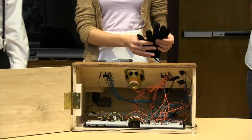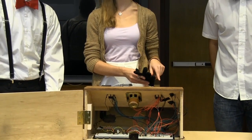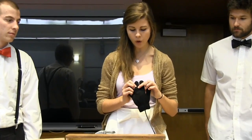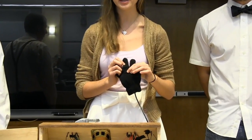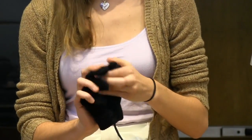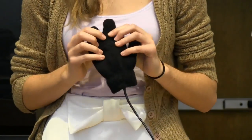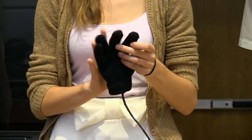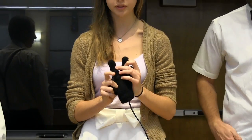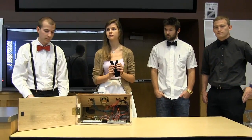The glove has two magnetic reed switches in it. We chose to use magnetic switches so that with the range of motion, people could use different symbols with slightly different hand positions and still get the same output. One switch is right here with the magnets right there, and one switch here with magnets here. If I close my fist, the lower switch would go high. If my hands are in scissors — these ones down, these ones separated — neither of the inputs are high, so it would be a scissors output.